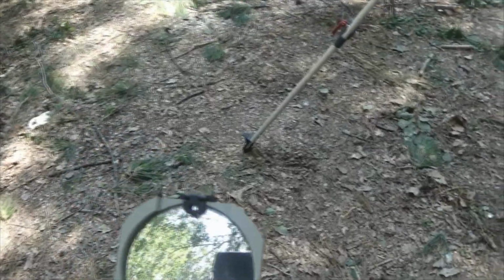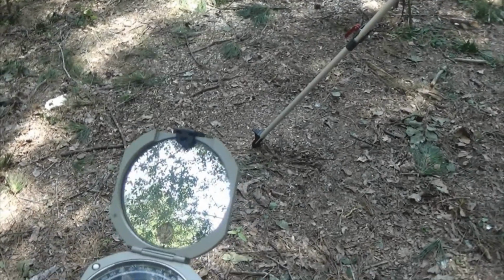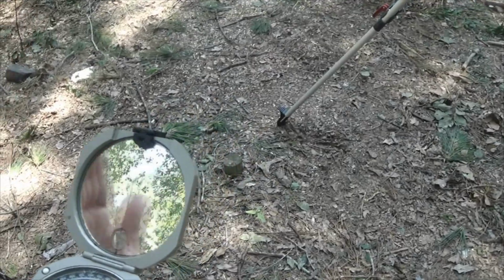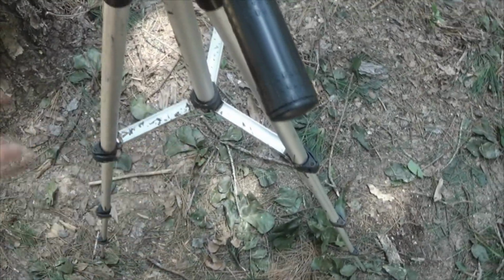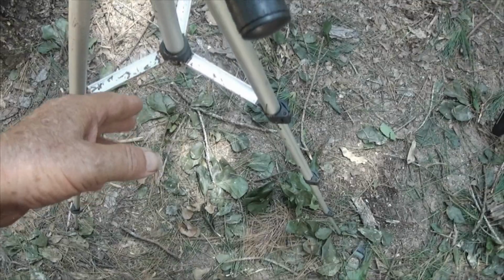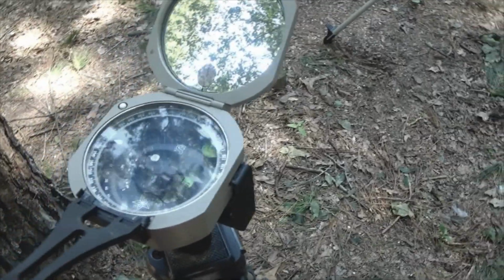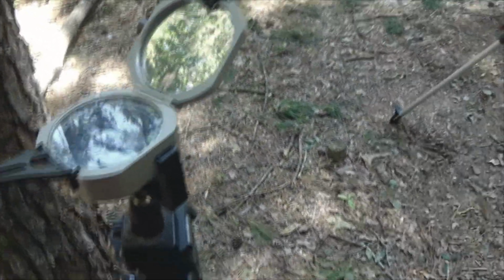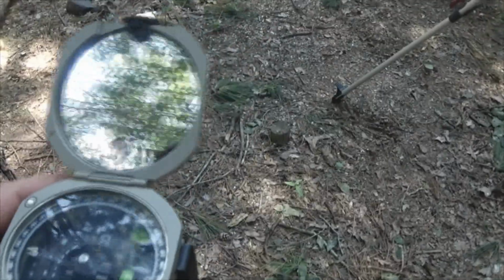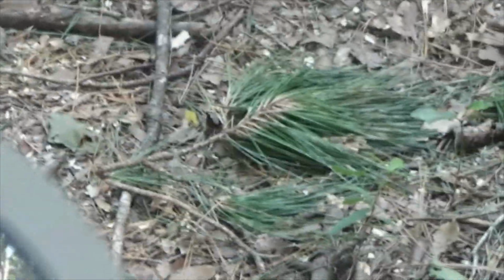It's a little different from the next method of drawing maps that I'm going to be showing you, but this does work. It's very accurate, but you need a point that everything's going to be measured from. You should use a survey stake buried into the ground, and every time you come back, set up on the exact same spot when you're surveying. This will help you to map out very quickly. In this case, we know it's 90 degrees, 16 feet. We turn to the next tree, that tree that's standing up, and that one is 60 degrees at 18 feet.